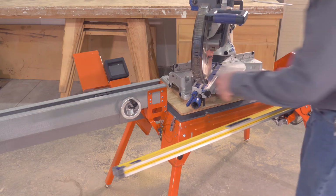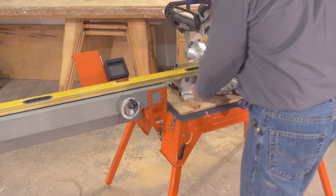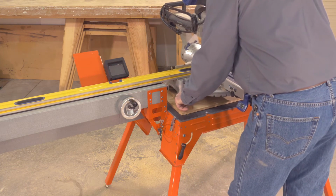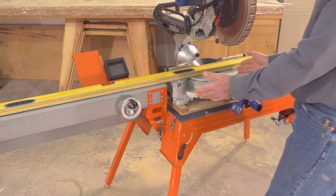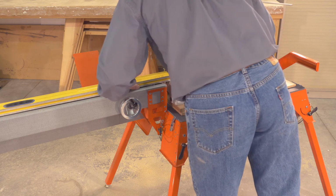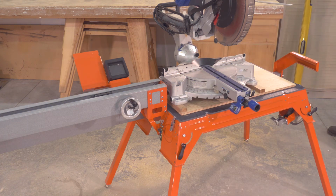And we'll check that the plane of the fence of the saw is in line with the back rail of the correct cut. So we line that up, pull our saw forward to meet it, and adjust it. It's recommended that you get as close as possible to the rail, so you can cut short blocking more easily. So again, double check that everything is in plane and lines up. Like so. We know that the height is good. It planes through. We confirm that with our spacers of the correct length, or width and thickness.